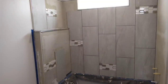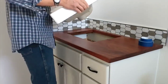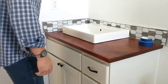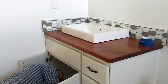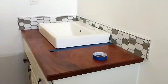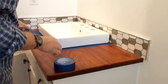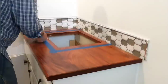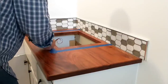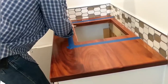Back to the vanity - it's time to set the sink in place. I'm doing a test fit and it's not going down all the way - I installed one of these before and it fit fine, so apparently there's a slight difference in the casting causing this problem. I mark with tape exactly where I want it to set since I know I'll need to lift it in and out several times to get it fitting perfectly. I got my pocket knife out and trimmed along the edge to cut a little chamfer because the template didn't put the hole in quite the right place.